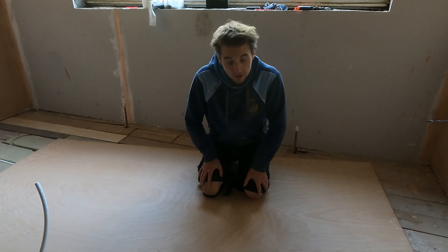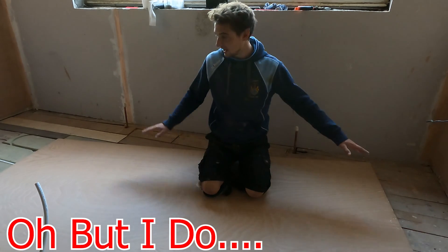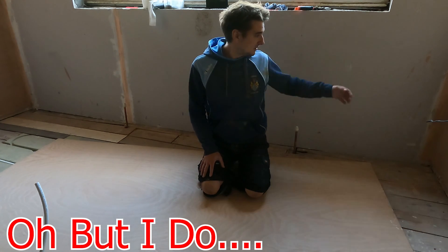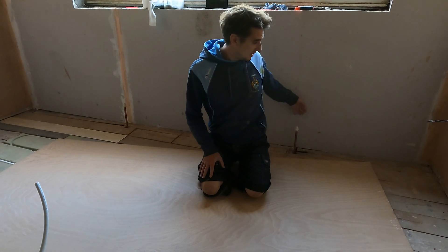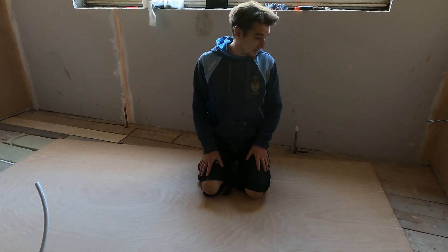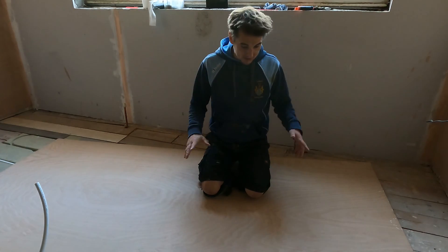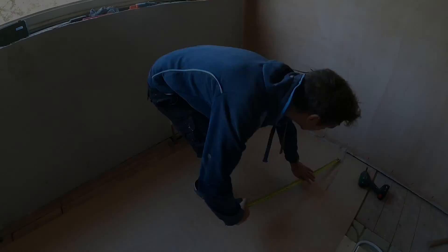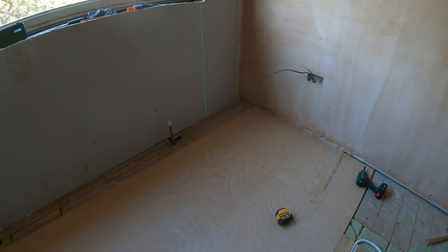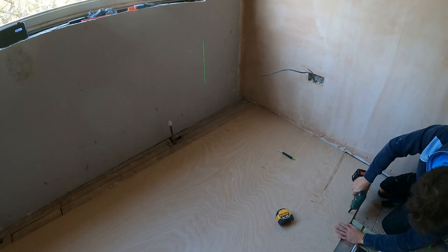I'm now going to get into this — I probably won't start videoing from the very beginning of laying the sheets, because surprise surprise this wall here isn't straight. I'm going off the side which is as straight as I think it can be, I've got all my angles, and I'm shooting laser levels — you'll see. When laying the plywood it's exactly the same care as the chipboard floor: I'm marking out the lasers to locate the actual joists, which gives me the ability to know where the screws need to go.